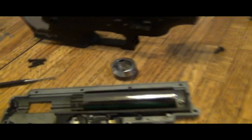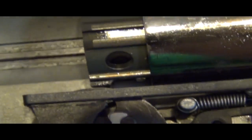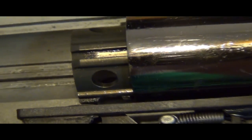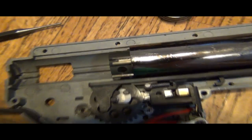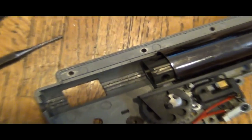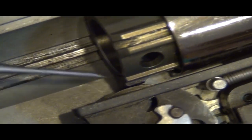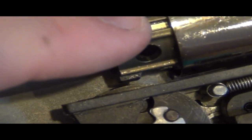Now, just to say, the pickup tooth was touching a little too much when I did my test with rotating the sector, and it created resistance holding the sector down. I've previously Dremeled and shaved that pickup tooth so that doesn't happen again, and we can kind of see that the hand is creating shadow, and the camera, so I'm trying to get away from the shadow just to show how close that is. You can see right here how close it is, but when it's closed it pulls it up a little bit like this, so we should be okay, and I can check that again.